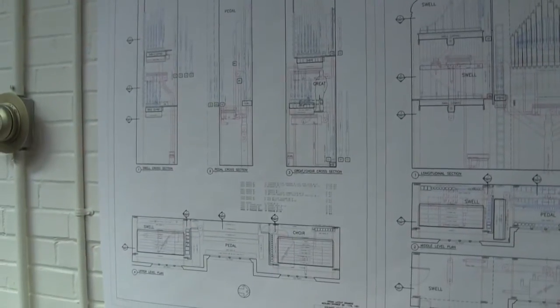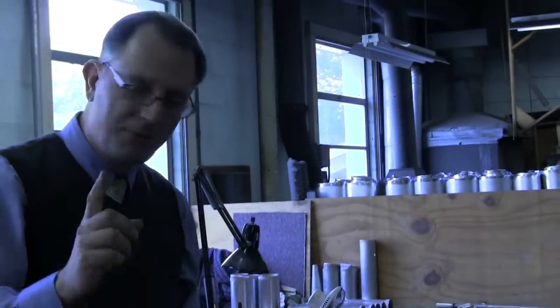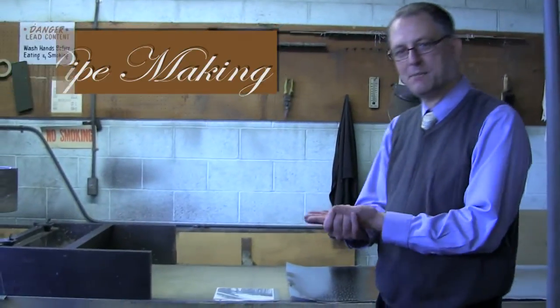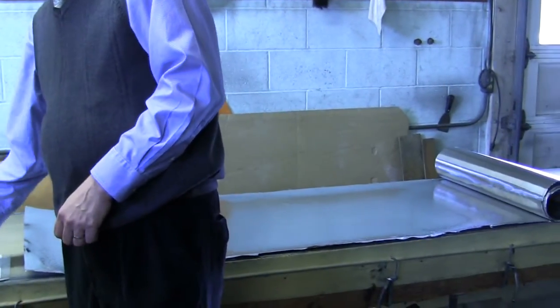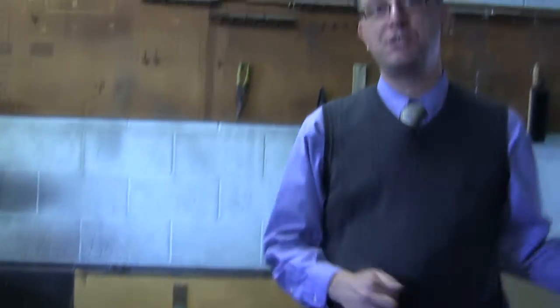Organ portions are computer renderings, and the photograph is an actual photograph from the room. The whole concept of pipe organ metal — spotted metal for organ pipes — was developed by a monk in France about 500 years ago, when metal was cast on sand rather than on granite as it is today. We combine tin and lead in a cauldron and pour it down the length of this table. As it draws down, it deposits a thin layer of molten metal on this granite table, which is covered with canvas because it draws the heat out of the molten metal very quickly — so quickly that about five minutes after casting a sheet, you can pick it up and work with it.